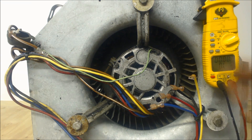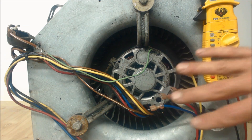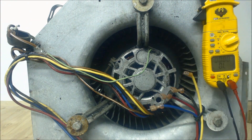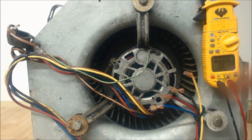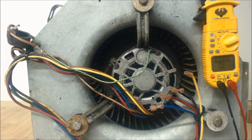If you're finding that you're not getting the right airflow out of the registers, then it may not be the actual blower motor that's the problem. It may be the friction applied across the filter, it could be dust on the wheel — you want to clean that off because it would slow the airflow down. It won't slow the blower motor down, but it will slow the actual air molecules coming through your ductwork. There could be an obstruction in the ductwork, or the ductwork could just be too small.